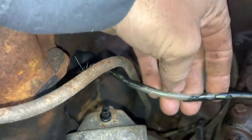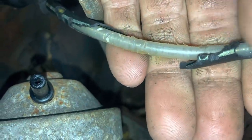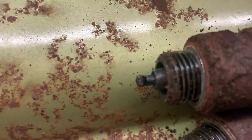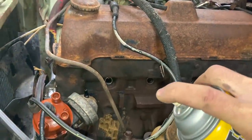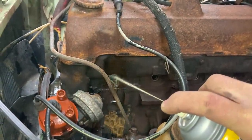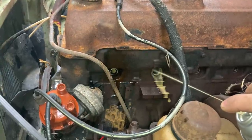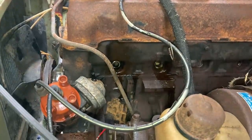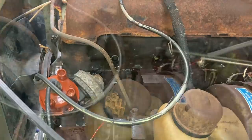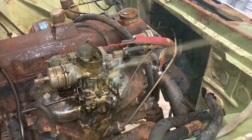Look at these plug wires — it's like hard plastic inside, and you can see the metal coil inside there. I've never really noticed that before. Here's what our plugs look like. Typical carbureted stuff right there. That front one's a little lighter than the rest of them. Since this motor's been sitting 40 years, usually I just put Marvel Mystery Oil in them. But I'm going to put PB Blaster in this one because that's what it's made to do — break loose rust. Some of you guys have been saying use vinegar; I've never tried that one. We'll give all this stuff another coat too.